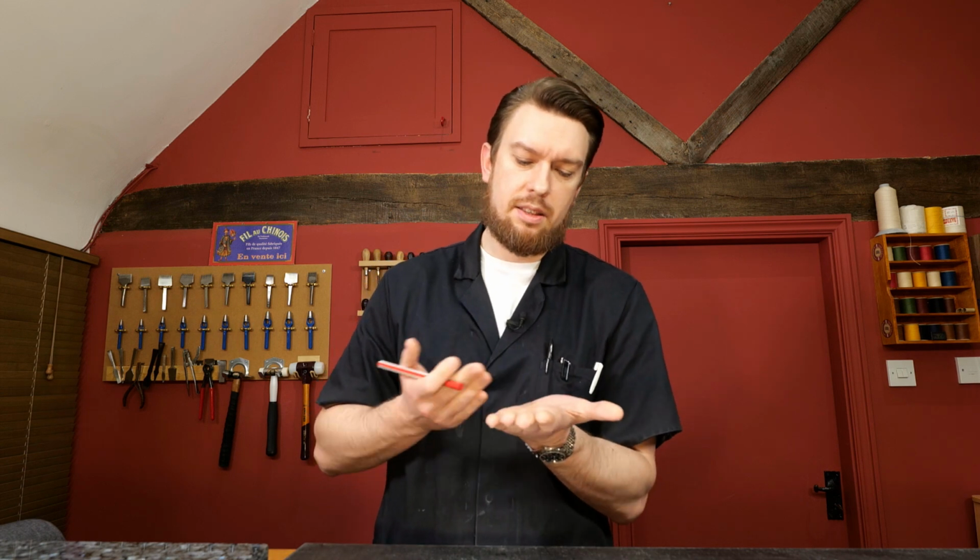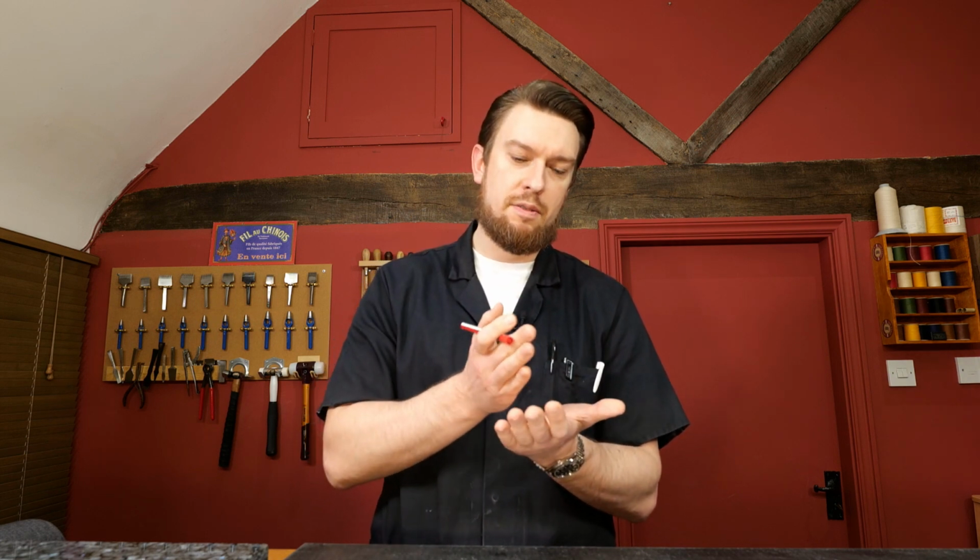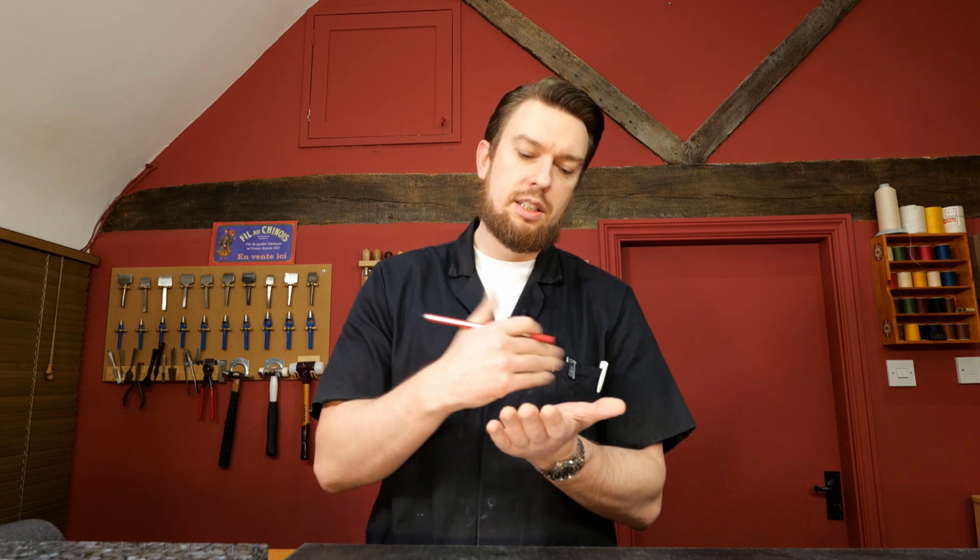So you would get, say for example, a diamond plate, and you, with the teeth placed down on there, as if you were going to prick mark the diamond plate, and you would just move it backwards and forwards, say 10 times, turn it all the way around, do 10 times again, and keep going, just to mitigate any bias you have on each side. Just keep twisting it, moving it backwards and forwards, and grinding it down until you've basically got flat spots on all of them, but it's a consistent flat spot.